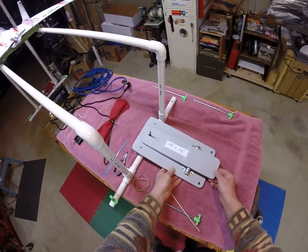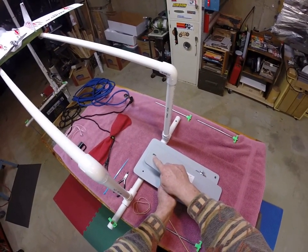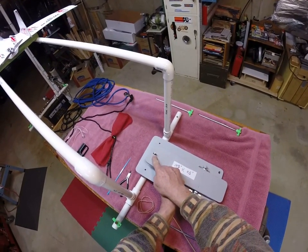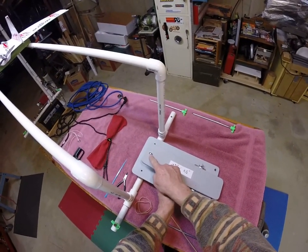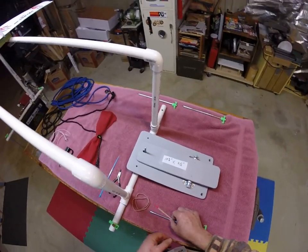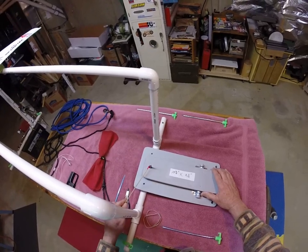In the front of the pedal you must cut out a little slot or a very round hole — it doesn't matter. I drilled two holes a little bit bigger than the quarter-inch bolt, about half an inch apart, then took a jigsaw or file to file it out. As the pedal rises up it goes in an arc — you can see it swings back — so you have to allow room for that arc.